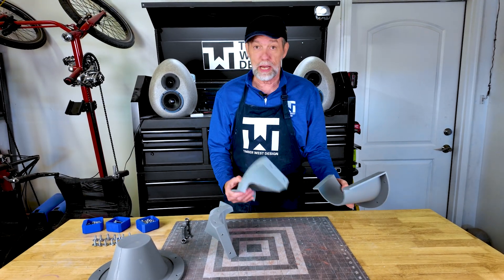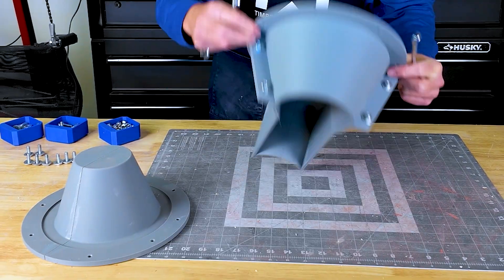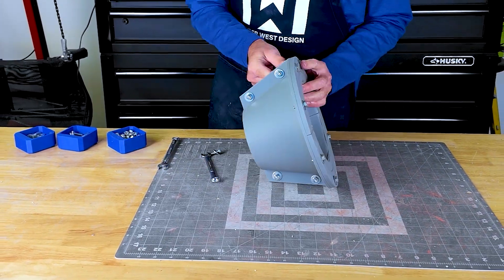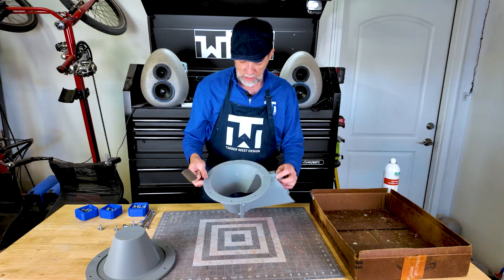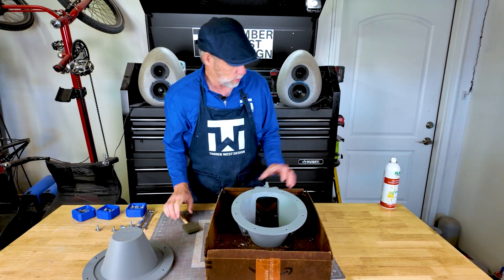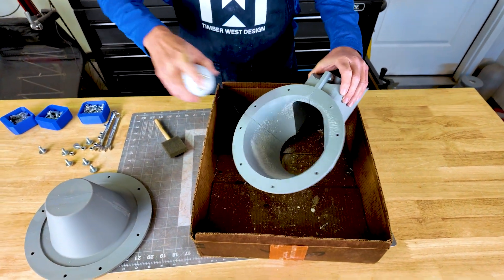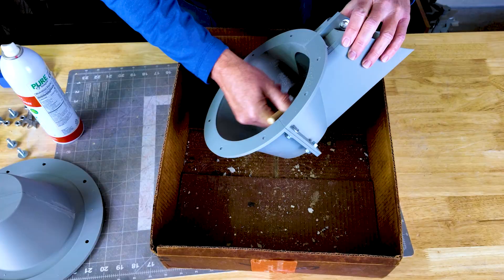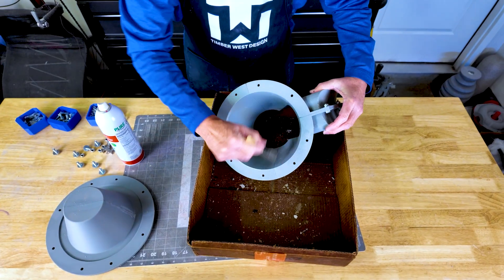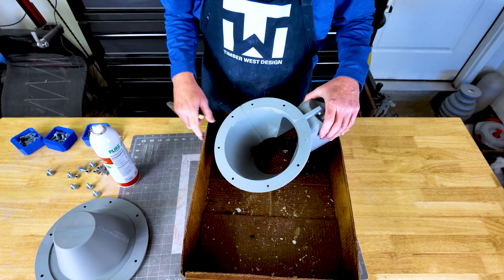The 3D printer is done printing. It's time to put the molds together. I'm going to get some quarter-inch bolts and start getting this thing ready to pour. Before I put it completely together, we need to put mold release on here. I'm going to put it in my mold release spray box — I use canola oil. Just brush it on, get it all spread out, make sure it's nice and even with no puddles. I'll do this on all the mold surfaces on both parts, then continue putting it together and get ready for the pour.